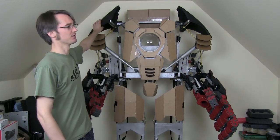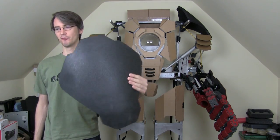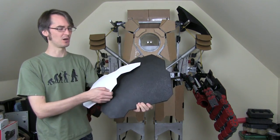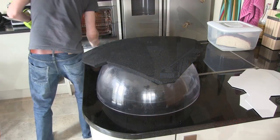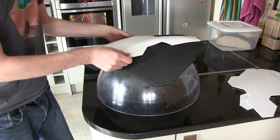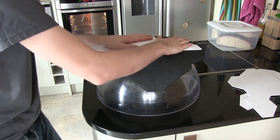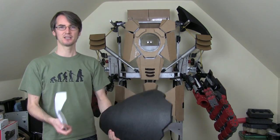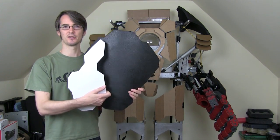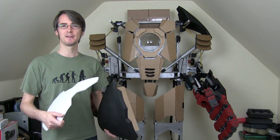Then we started the shoulder bells. These are made of foam, and then there are some other foam PVC sections which fit over the top of them, and we formed these up with heat. The foam PVC was baked in the oven and the other foam pieces were heated with a hot air gun and formed over a large hemisphere. Today I'm going to go into painting and sealing them, doing the 3D printed detail features, and hopefully fitting them on.